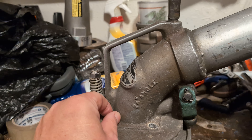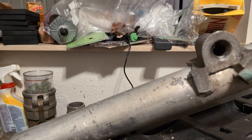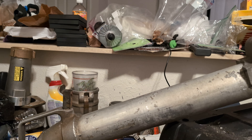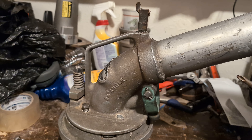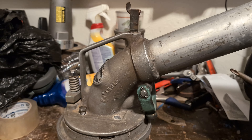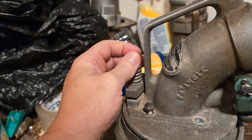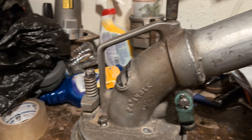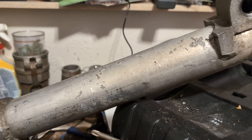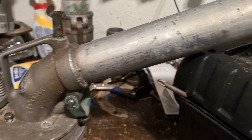You would set it to prevent coasting if the gun was on an angle or kind of on a slope terrain, so that when the gun's rotating and it comes up to that slope it wouldn't get stuck in one area because gravity is pushing down on the gun or making it stay. Basically what you do is take this bolt here and tighten it, and that would add tension so the gun would actually turn slower.